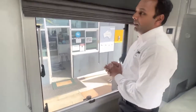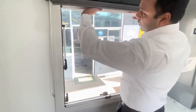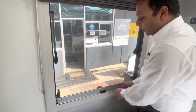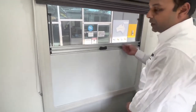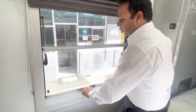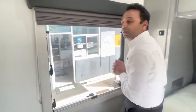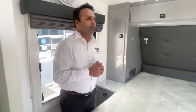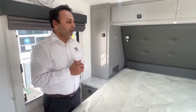For the window blinds, always use two hands with equal pressure on both sides - top one down to the bottom. The lock is in here; you can adjust it up and down. Release it, put it halfway through, lift it up, then push down manually or push it up manually. It's nice and simple - it's only trial and error, so you'll learn as you go with experience.